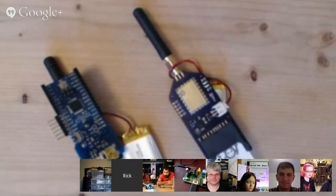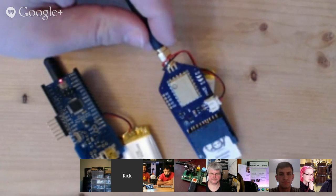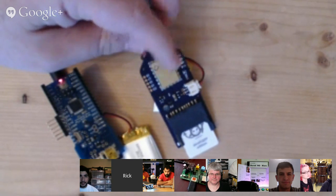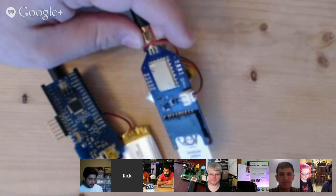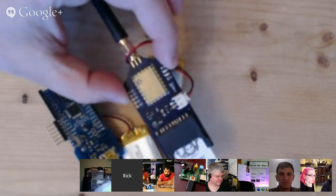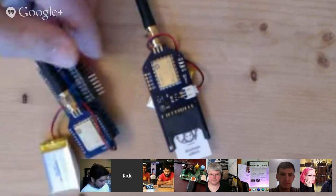Great. And I ordered, like I said, an electric imp and have been messing around with it. And so I'm trying to work on a bridge for the imp. The imp operates off of Wi-Fi, and what I've done is I've partnered it with a sub-gigahertz radio. This is called ERIC, E-R-I-C, and they're pretty inexpensive. They're like $10 or something a piece. So the imp is running, I don't know if you can quite see that, but it's just simple serial. It's sending the value of its internal light sensor, and it's sending it over here. And I've got another on the back of this guy right here that's receiving.